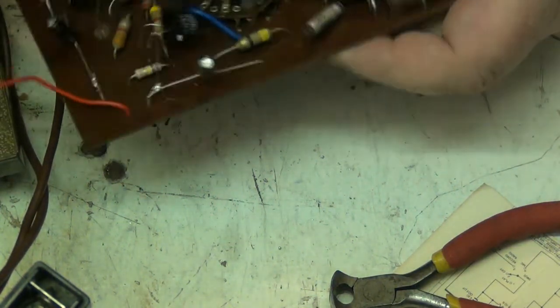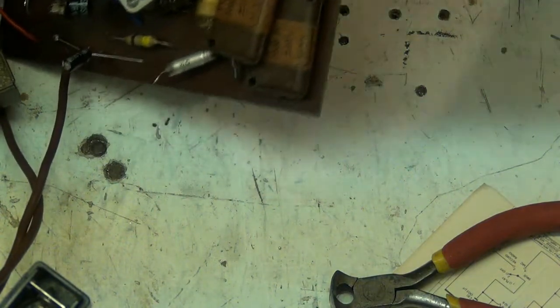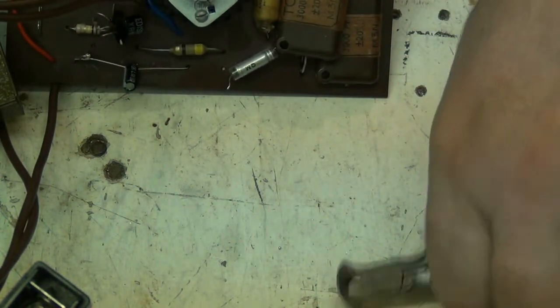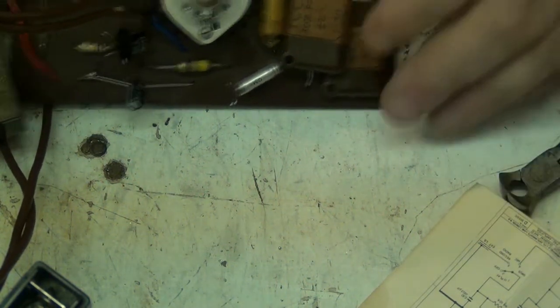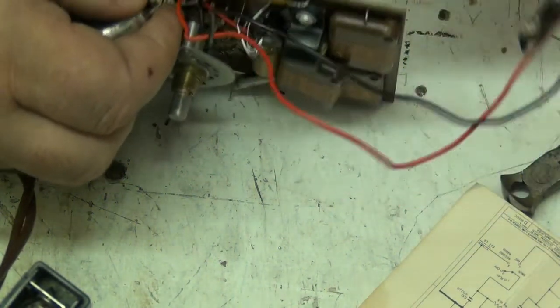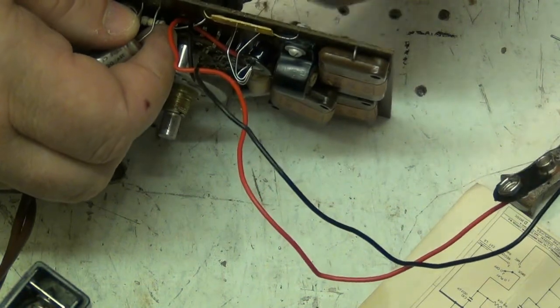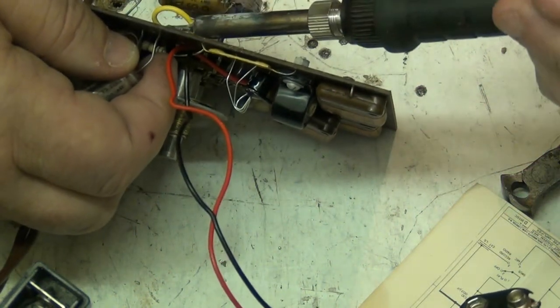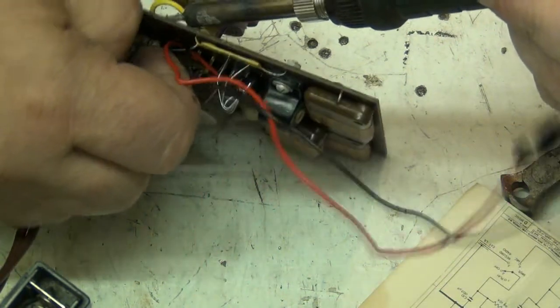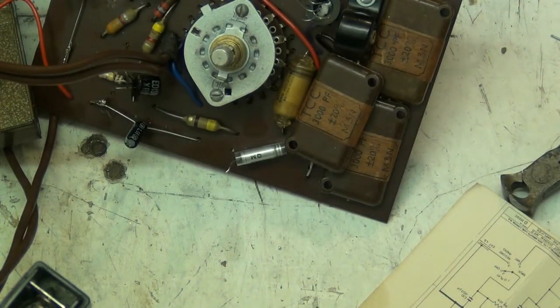Yeah, they're a bit crappy, these freaking capacitors. Now we're wide open. Oh, the one on the end there was wide open. Right. In the other way, just move that bias wire and try and, we'll test all them in a minute. We'll just get them replaced first. That's the 4.7 microfarad, so put that one there for last.